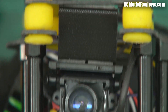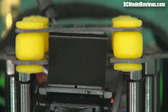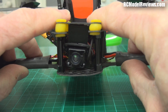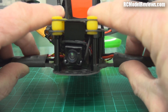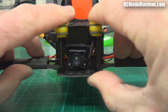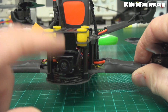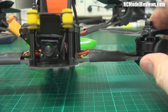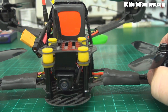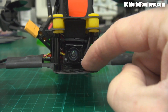The reason it's tilted is because it is taped to the Mobius platform with some double-sided tape, and for some reason it's more compressed on one side than the other. That's another one of my dislikes — why put your flight camera on the Mobius platform? There's no sense to it. It's not going to stop jello because these are far too stiff for that, and if you have a really bad crash and this gets ripped off, your video camera goes with it, probably ripping the wires out the back. I wish manufacturers would just stick to mounting the live video cameras to the frame.